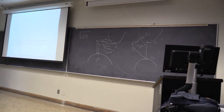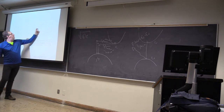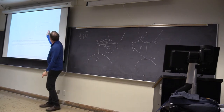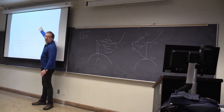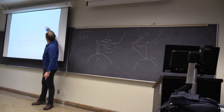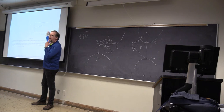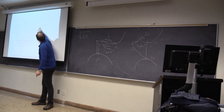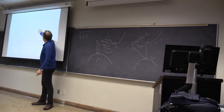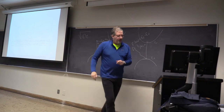Yeah, so you can vary these. As you vary the alloy composition, you can vary the different valleys here and thereby change it. So in this particular material, AlGaAs, we can convert this from a direct band gap infrared emitter to a red direct band gap, and then it becomes indirect. One possible cliche thing for that lab, if we reorganize that lab and have you do an LED, we could have you do a red LED right about here, 35%, which would emit in the red, and we could make it in the shape of a block O if we want to be a little cliche.